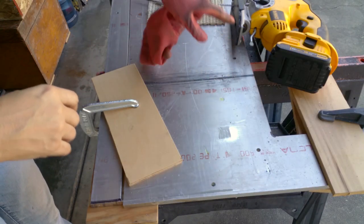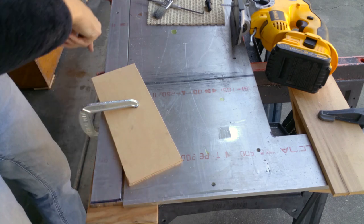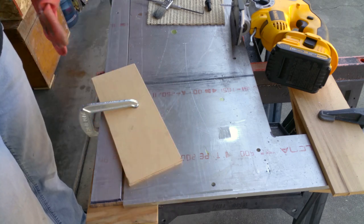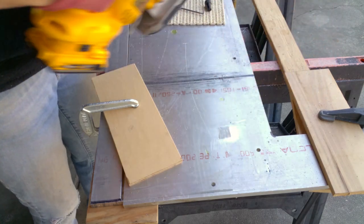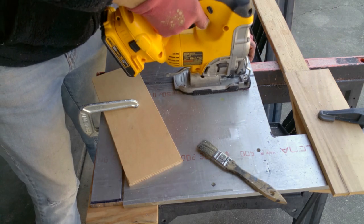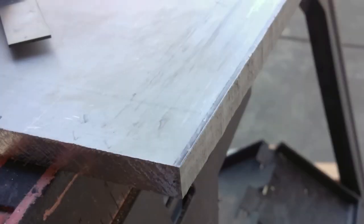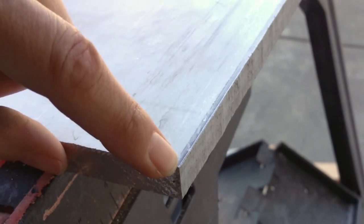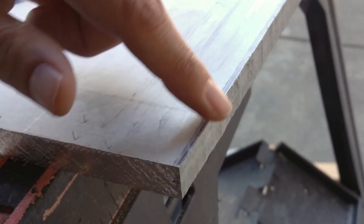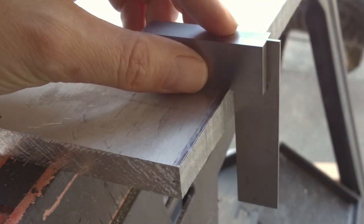I have most of the cut done. I clamped some little boards here underneath to support this, and there's a little clamp here to keep this from tipping over this way. I'm still going to take it easy and try to get a feel of what it's going to do. Dr. Lewin once said, if you don't know your uncertainty, your measurements are meaningless. I probably have about half a millimeter tolerance on this and it's fairly square - I don't see much light.